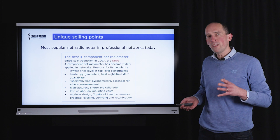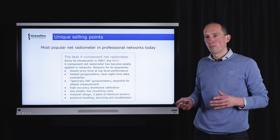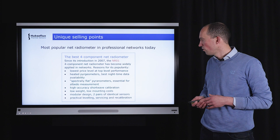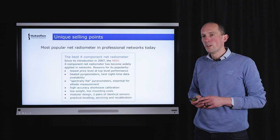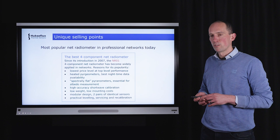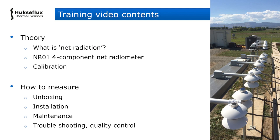The instrument is low weight, making it easy to handle and ship. Mounting is very practical and integrated, so it does not require much extra hardware for installation. The design is modular and the sensor pairs are identical, meaning if a small part breaks you can replace one single pyranometer instead of the entire instrument. The leveling assembly is very practical, and these instruments can easily be serviced and recalibrated.